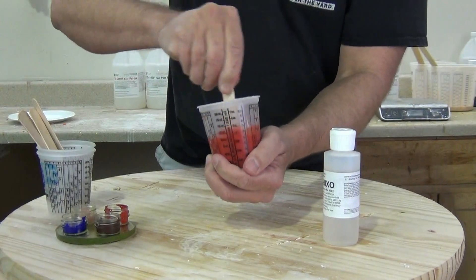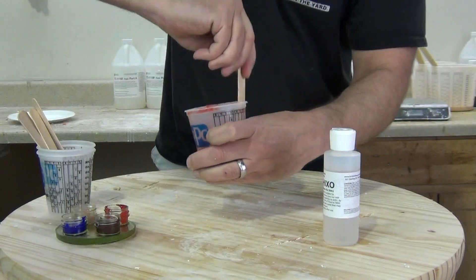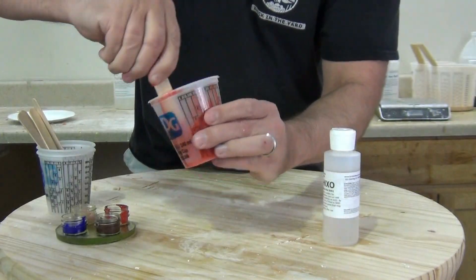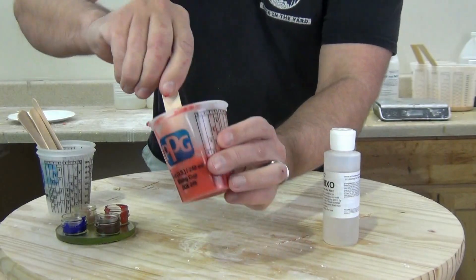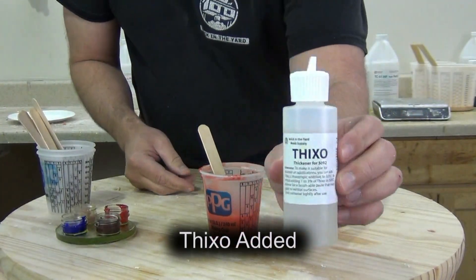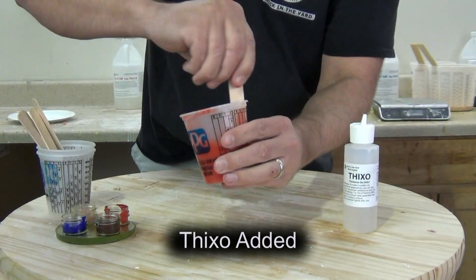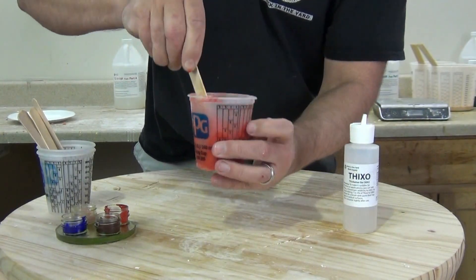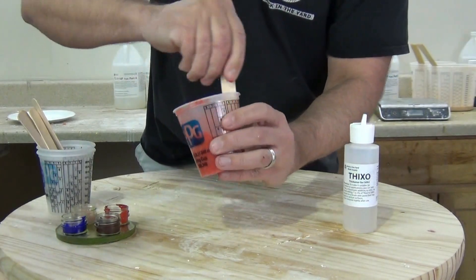If you're doing brush-on molds that require a little extra attention, 5130F has enough time to do that and still has that fast 1-hour demold time. Here we have our silicone mixed up with just a little bit of red pigment to make it easier to see. Of course, always make sure you're using compatible pigments — here we're mixing silicone so we're using silicone pigments. Just like with the 5110, we're adding just a little bit of the Thixo additive. Adding just a little gives you a slightly runny paste, but in this case we added just shy of the 1% mark, giving us a nice thixotropic, almost peanut-butter-like paste.